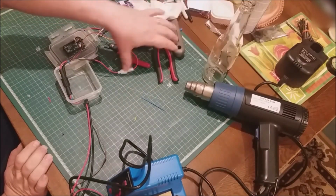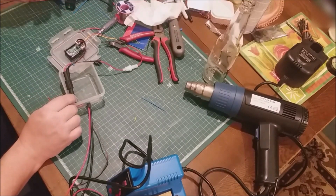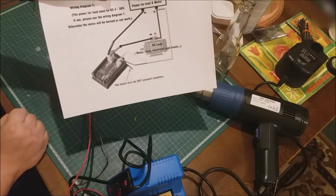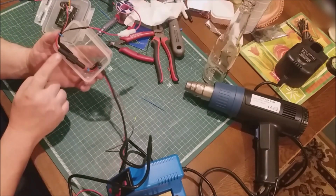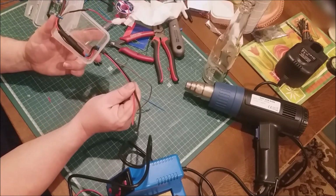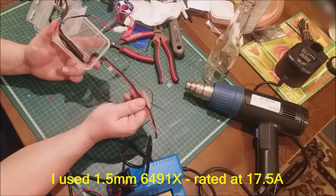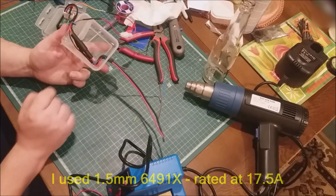Very untidy workbench, but that's always the way it is with me. Anyway, before I put it together, I'll cut in proper colour stills of this. I've only got a black and white printer here. But what we've got is the fusible link for the ammeter side, which takes full load current. So any wires associated with that side of it have to be capable of taking the full load current of your power supply or radio, and fused accordingly.